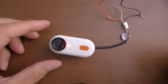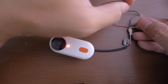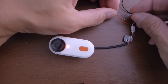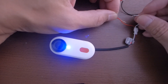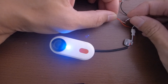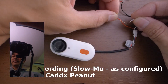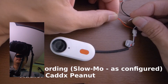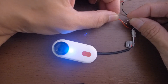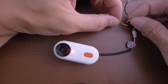Being careful not to short the cables, I'm connecting the adapter to the Caddx Pinup — it's charging, showing a red light. Let's see if we can trigger recording. Connecting the white cable to ground does nothing, so trying it on the red cable — that did something! It stopped recording, or maybe it's turning on. It seems to be powering on and then starting recording.